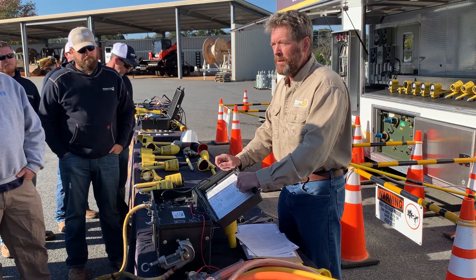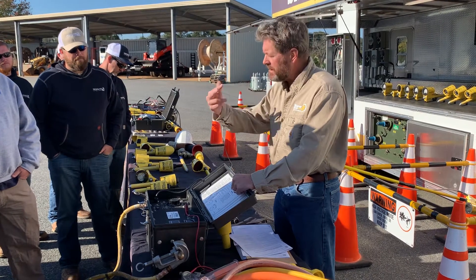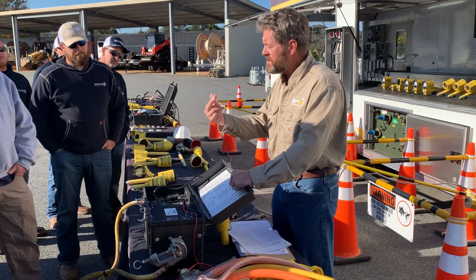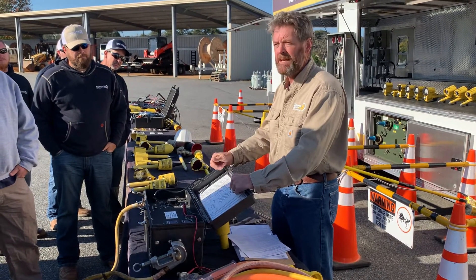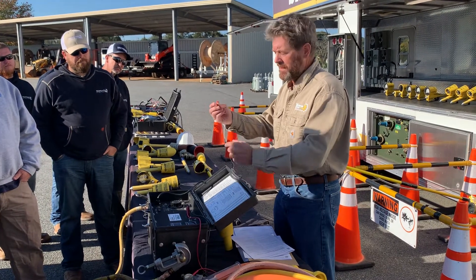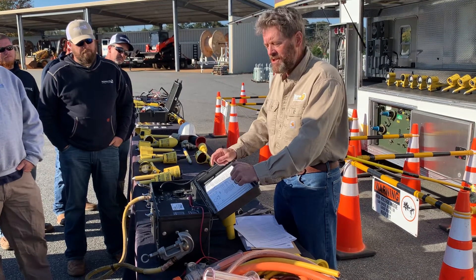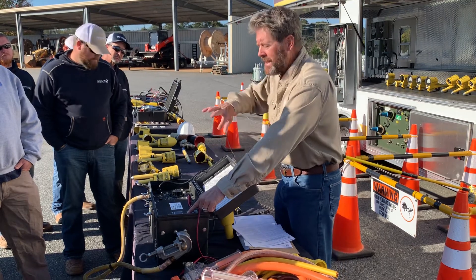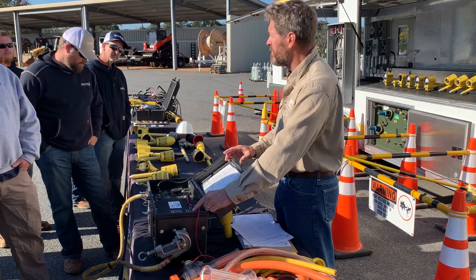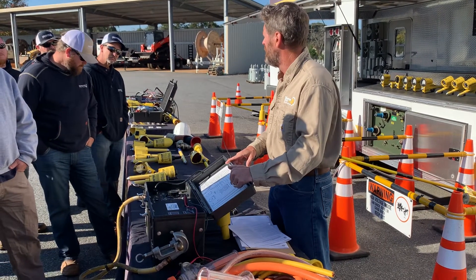The ones I've visited in the past — when they pull their temporary personal grounds off the truck, I can visually inspect them. They weren't visually inspecting, but you're supposed to. I see broken strands, oxidization, dirty clamps and connections. I tell them they're not going to pass. Sure enough, when you turn up that continuous current, the thing fails. And when it fails, those temporary personal grounds would not have protected the worker if hit by a fault current.